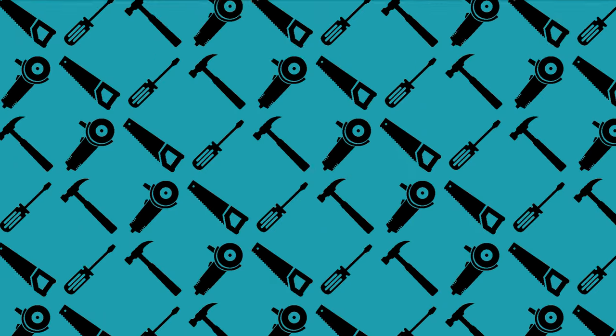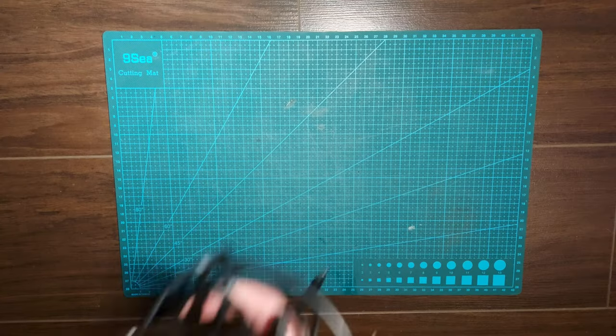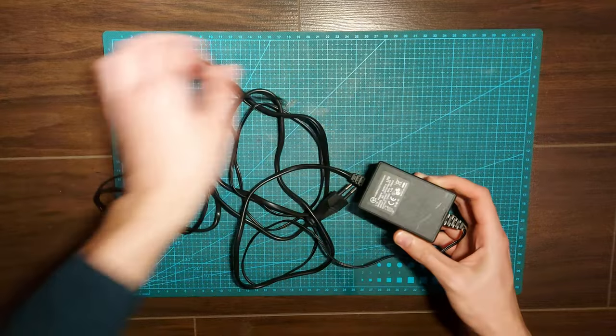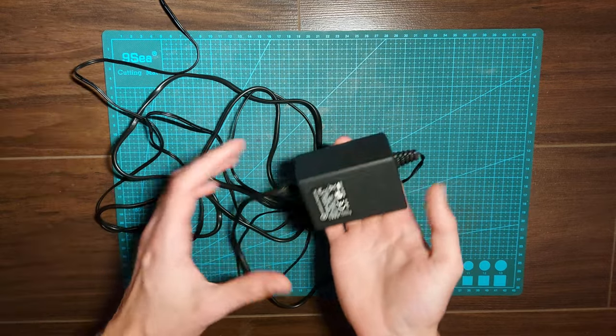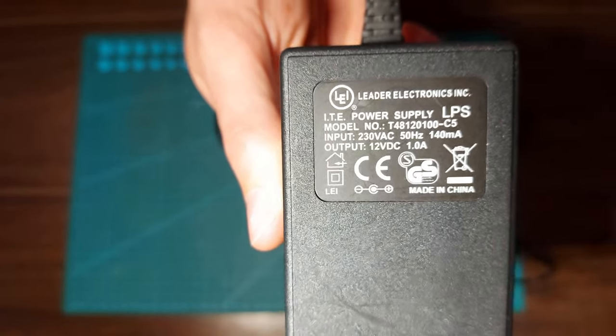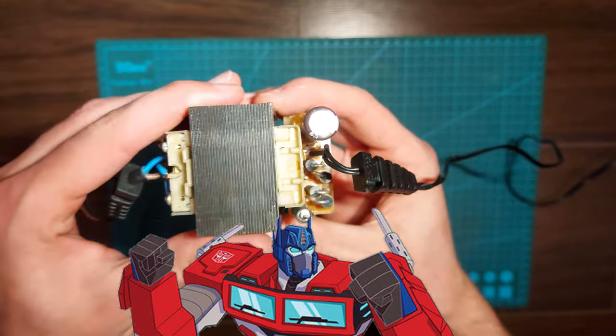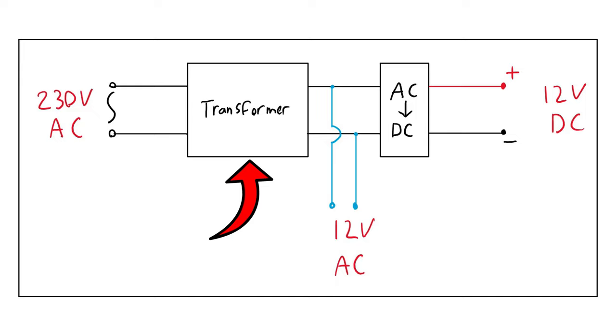And that is where this project comes in. We are going to make a power supply outputting 12V DC and 12V AC. I started off with an old 12V DC adapter — it needs to be an old one, as old adapters contain a big transformer. You can get them at thrift shops; just make sure it's heavy and cube shaped. This adapter already gives us the DC current. To get the AC current, we must open up the adapter. It contains a transformer and a little circuit behind it. The transformer only lowers the mains voltage — that is 230V AC — to 12V also AC. The little circuit behind it converts the AC current to DC current, giving us the final 12V DC. In theory, we can just connect an extra output just before the converting circuit, which will give us a 12V AC output.